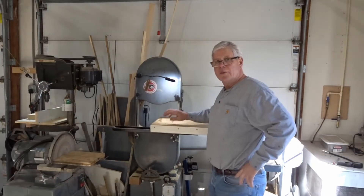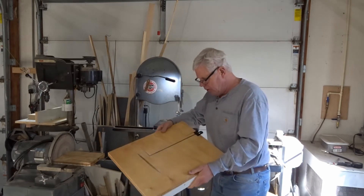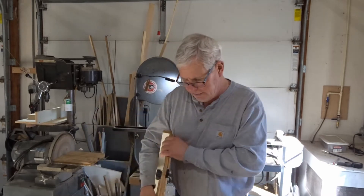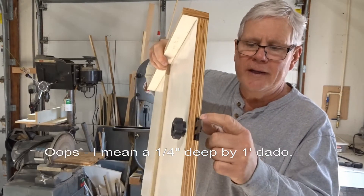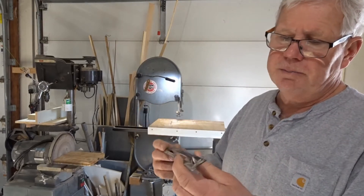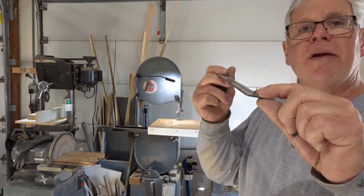So what I did was make a little jig from the band saw slot here, just out of scrap material I had around the shop. It's a piece of three-quarter fir plywood. What I did was take a piece of three-quarter plywood on the bottom and routed about a quarter inch deep rabbet in there by about an inch wide. Then I made this little piece out of a piece of inch by a little smaller than eighth - whatever gauge that would be - cut a slot into it and put a little pin right at the end of it.